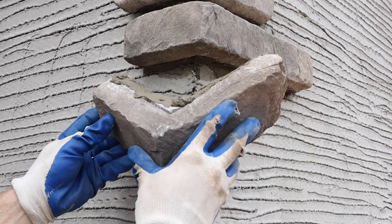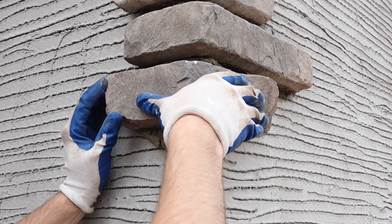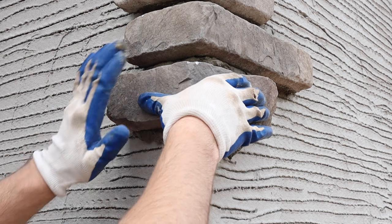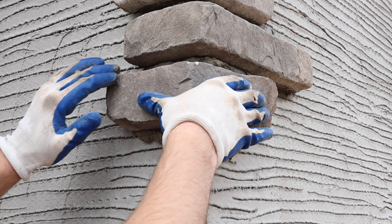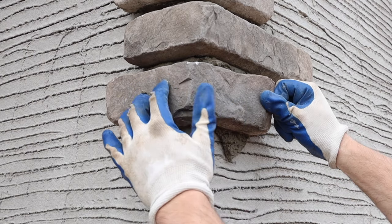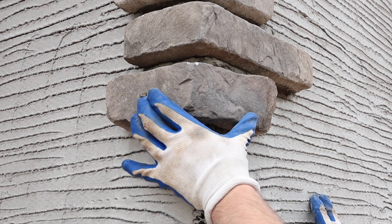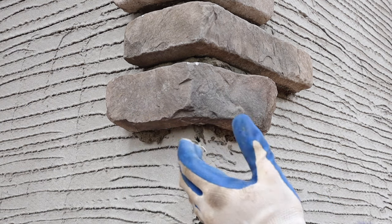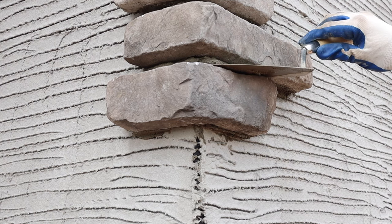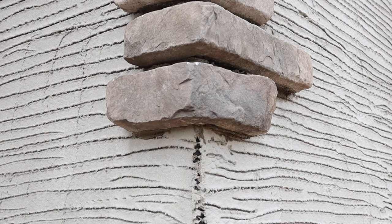We've got full coverage and now we're ready to stick it onto the wall. I lift it up to the corner, aim for about a half-inch reveal for the mortar joint, press it into the corner, and wiggle it into place. Make sure one side is not cockeyed compared to the other and try to eyeball a straight line. That looks really nice. Hold a little pressure on it for just a moment, then release slowly. I then collect the loose mortar off the bottom and recycle it for the next corner.